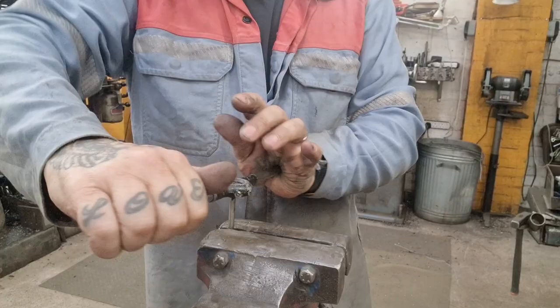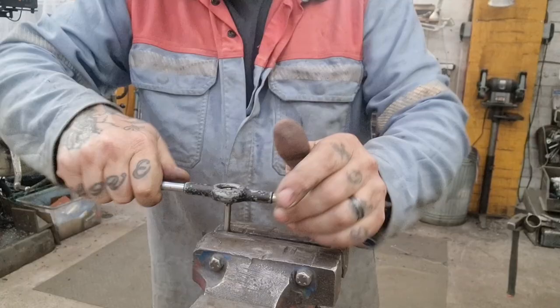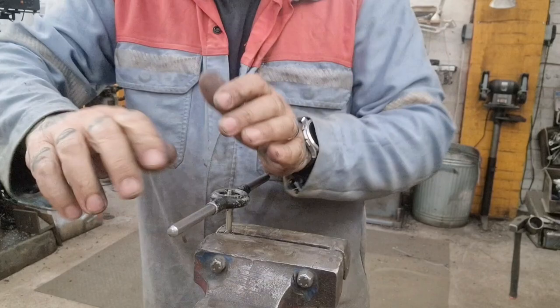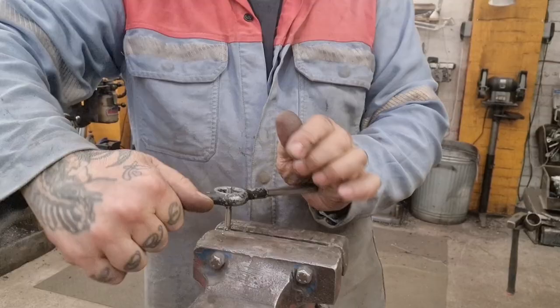like so. I normally go 1, 2, 3 and then back to break the chip. So it's 1.5 turns. I think the books tell you 3/4 or even half, but in real world terms, we can go a bit more. 1, 2, 3 and back a bit. We're looking at the mark. Oh, it's down there. So we've a way to go yet, but I'm sure you get the picture. Yes, we see. There you go.